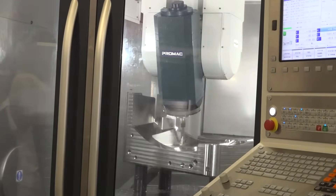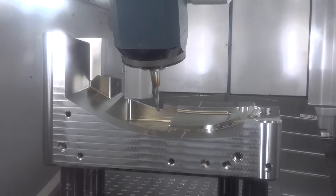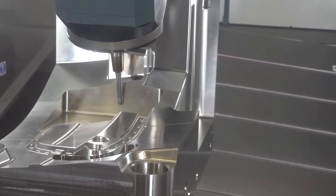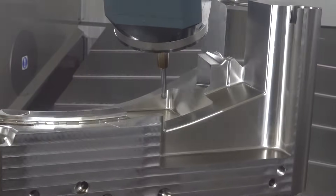Let's get into the details of this machine — we do have a part running now. Let's reiterate some of what we spoke about before, because it was in theory before when we climbed in the machine with no part running. Let's talk about what we're doing here and not just being cool with the slanted bed. One of the unique things — obviously the slanted bed lets you put a very tall job on the machine and run it down the hill. Another feature we actually used on this part: you can run it up the hill and bring the head down below the surface of the table. We did some deep hole drilling — 22-inch deep holes on this machine. So this mold sitting in here, we roughed it, semi-finished it, finished it, and did the deep hole drilling all in one setup.